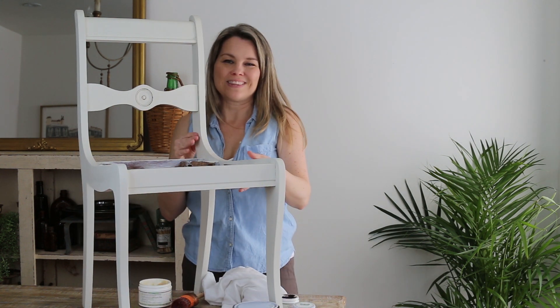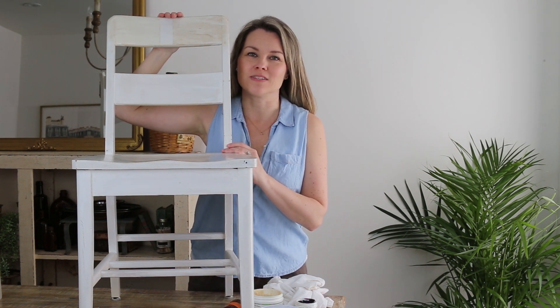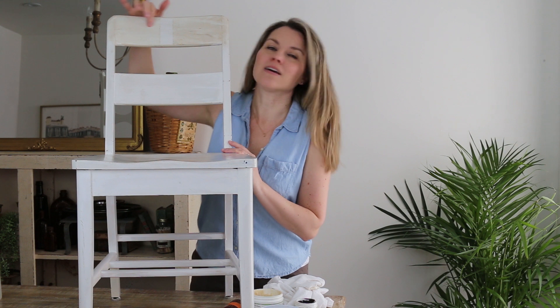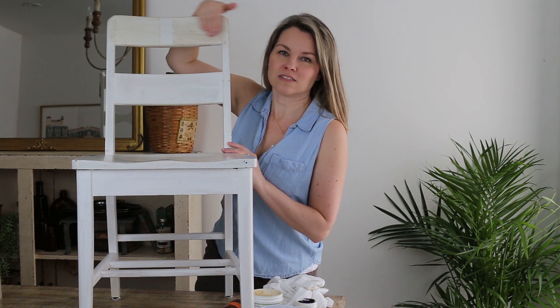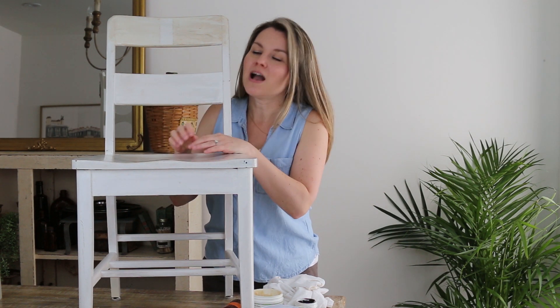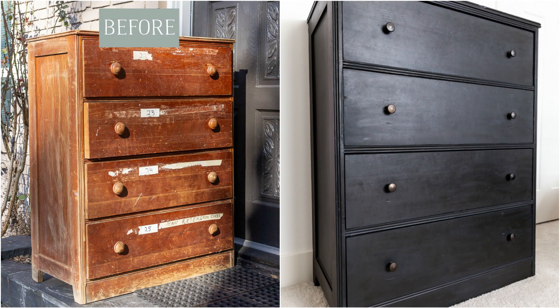That gives you an idea of how to use dark wax. I didn't want to do the whole chair, which is why I left it with just the medallion detail. In my blog post waxing tutorial, I showed the difference between waxing with and without clear wax first. On one side I added clear wax then dark wax and wiped it off; on the other side I added no clear wax beforehand, and you can tell it looks very smudgy — I really had to work to get the dark wax off. It's possible to do without, but it doesn't work very well.